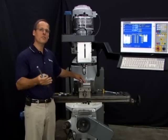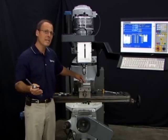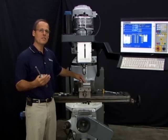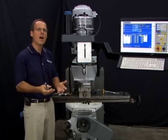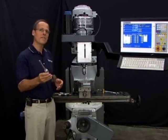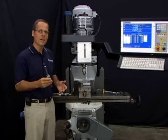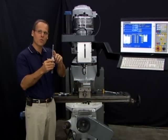So if you're a job shop making two, three, or five different parts a day with five tools each, you have to reset those tools each time — that's twenty-five tool settings in a day. With the Centroid reference tool method, it reduces setup time. If I have those five tools, I only have to measure them once against the reference tool.